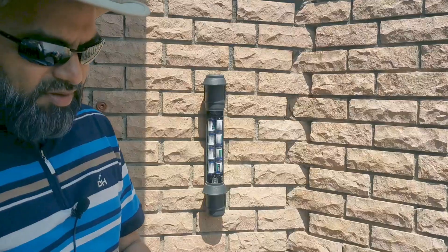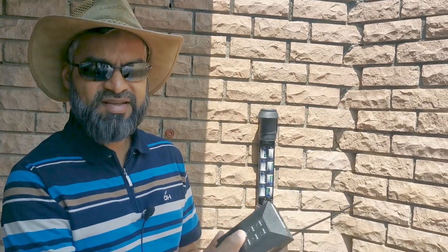This is zone 4, but strangely enough when I tried to activate zone 4 again it refused to activate. It couldn't have been that the zone was deleted, because the zone wouldn't delete unless I go into the zone programming and delete it. What I did was I just held down tamper, which is zone A, and then it beeps.